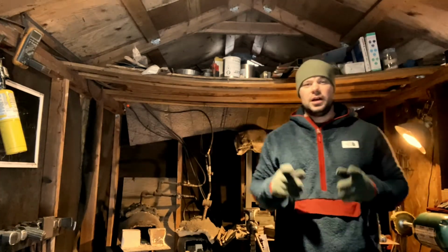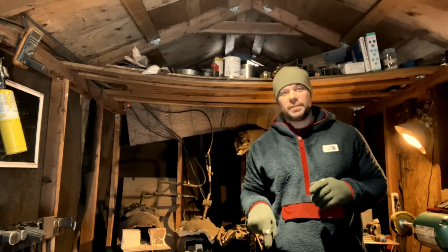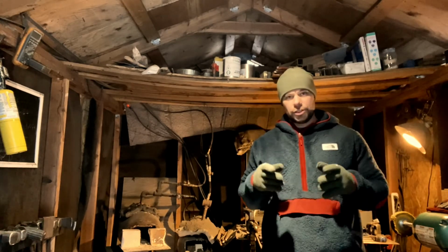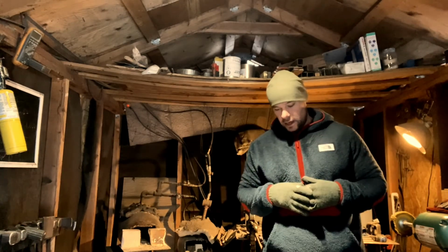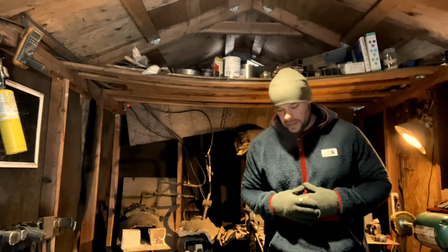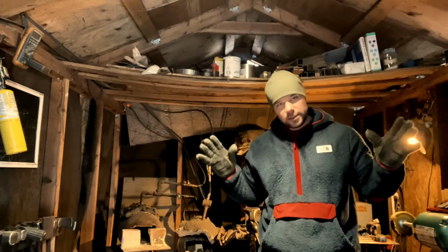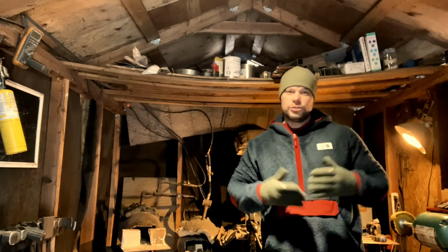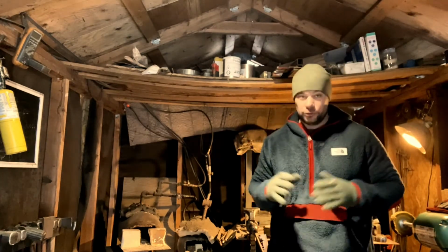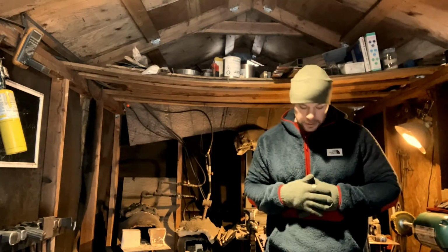Another thing I forgot to mention, something that I did recently was, I made a proper anvil stand for my anvil. It's just a three-legged stand. I'll bring the camera down and show it. It's really nothing special, but my anvil doesn't rock anymore. And it's amazing. I also siliconed the anvil to the base, and man, it really dimmed the ring. There's almost no ring anymore.